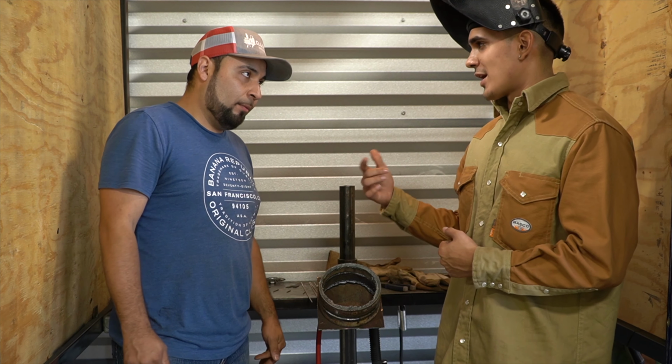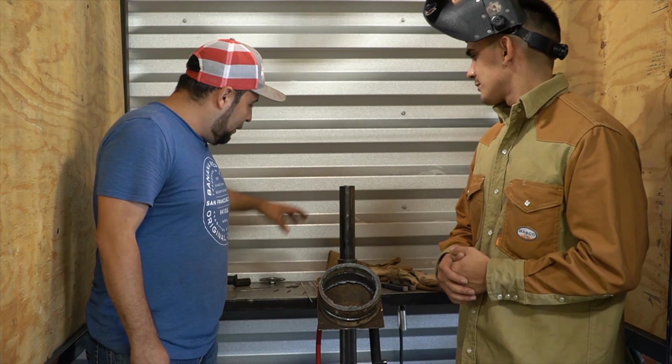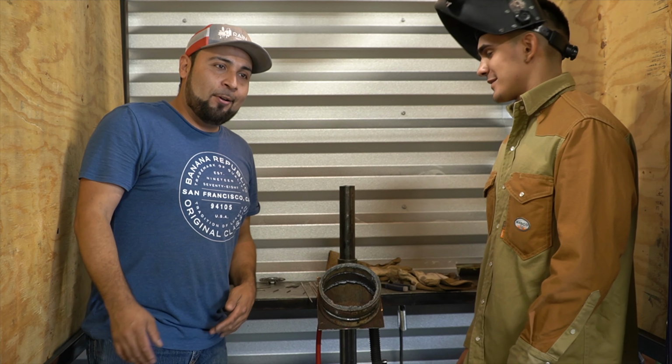I think I remember you telling me I always started the tack on the bottom. Yeah. Okay, so there's this one thing because I always tell my students, a lot of people will tell you, hey, tack it here on the table, which is good, it's not bad. But whenever you're on the field, I told him, hey bro, you need to learn how to tack on the bottom, because whenever you're on the field and you got a big pipe, like a 24-inch pipe, 36-inch pipe, you're not gonna tell that guy, hey, can you put it on the table and then you can put it back. He's gonna tell you, get out of here. We're not gonna be able to do that. So we gotta be able to tack in position.